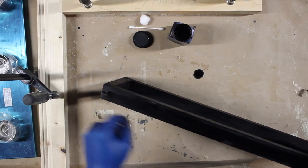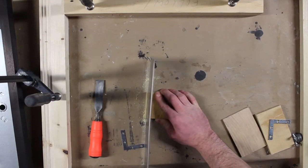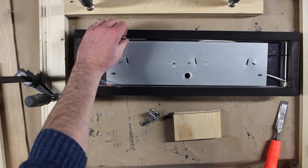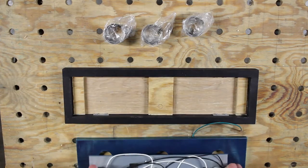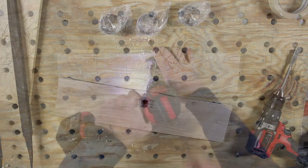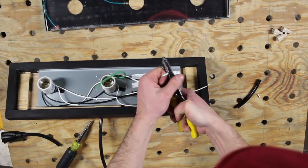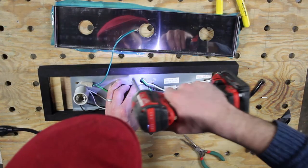With the frame built, it was time to start assembling everything. I used some eighth inch Luon for the back panel and then made some shims out of plywood so it would sit flush with the back. The wood shims also give us a way to mount the panel to the frame and a spot for the clamped connector to bite into. Some metal shims made from square brackets were also added to set the front panel to the correct depth. The holes for the wire clamp connector and the t-nut are then marked and drilled. Next, everything is wired up. Finally, the back panel is fitted into place and tacked in with some finishing nails.